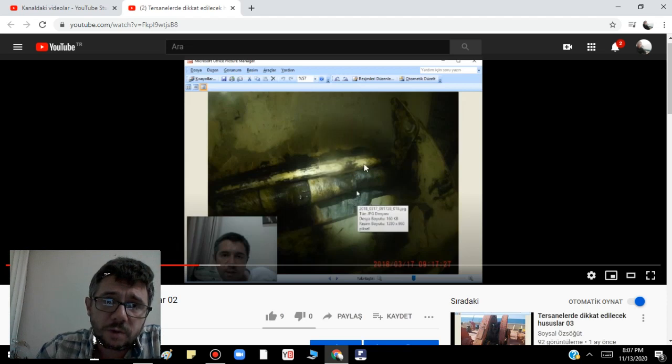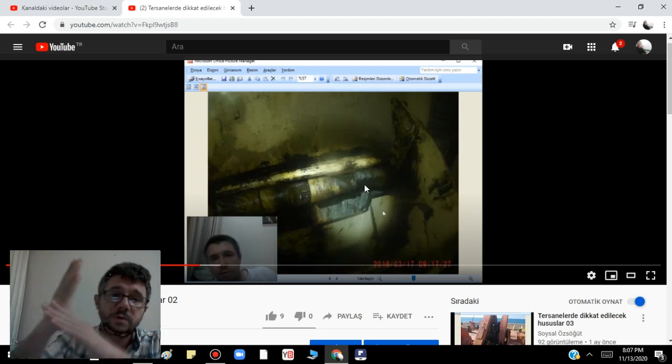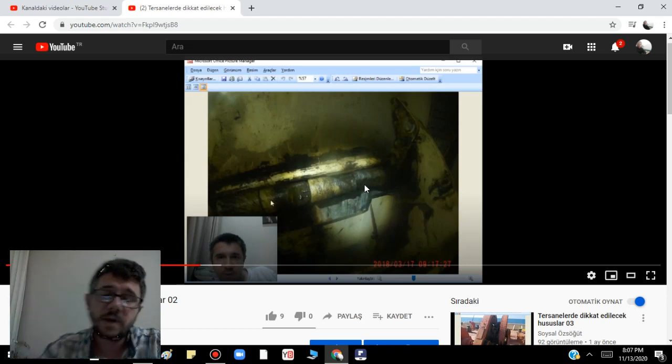This is the guider rollers okay, for the hoisting and luffing. You see these are in very, very poor condition — already sawed with the hoisting and luffing wires. Why? Because these are Teflon rollers. The idea is good, but the problem is: when too much time passes with the grease, the grease mixed with the cargo dust becomes stuck up. So these Teflon rollers are not intact, not one piece — they break into small pieces.